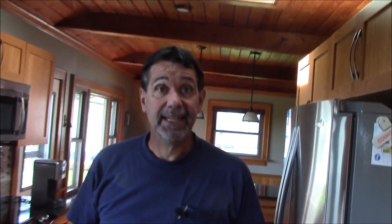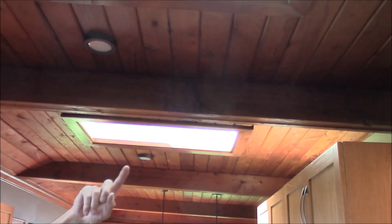So what happened is I added these two skylights, so I framed in from the roof down to the ceiling of this room, built the box, foamed it and drywalled it, and now we're going to go up into the attic. We're going to use Touch n' Foam two-part 200 board foot component kit to insulate the attic side of these tubes.